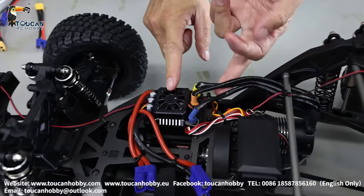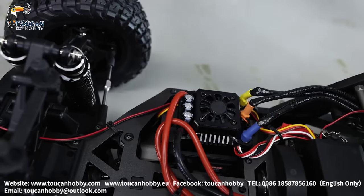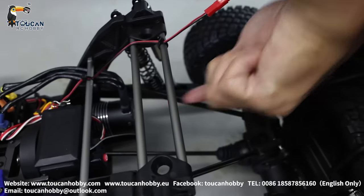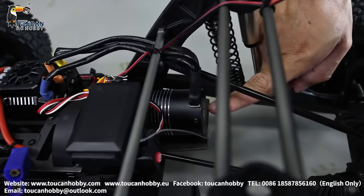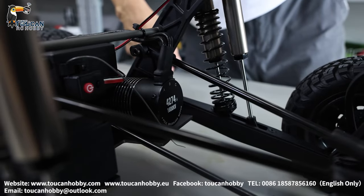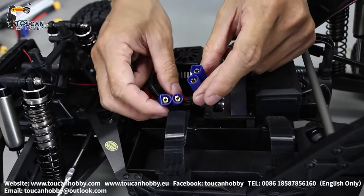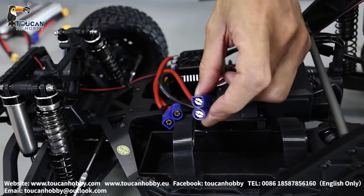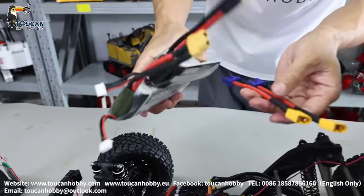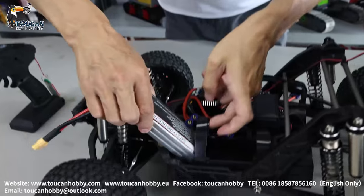That's the brushless motor ESC. In the front it's 158. It connects the power supply to the motor — it is a 4274, 1600 kV brushless motor. For the ESC, these connections are EC5. I don't have the battery connection directly the same, so I made the connection to XT60. With two 3S batteries or two 2S batteries, we will be able to make it work.